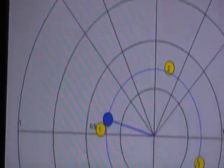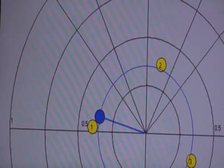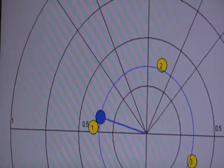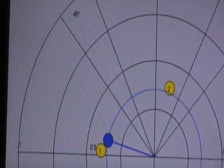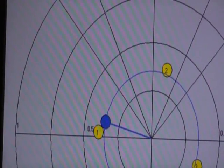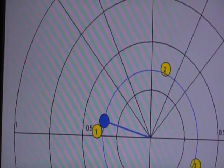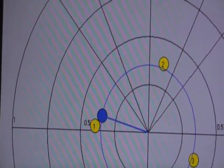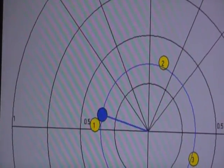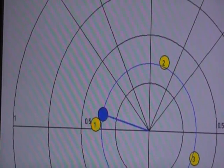So what this means is that we have to rotate the ferrule about maybe 60 degrees. You have 6 keyways in it, so you have 6 possible positions to rotate it. So we need to rotate it to the second position over about 60 degrees. So that's what we're going to do here.